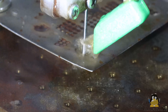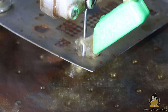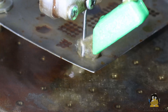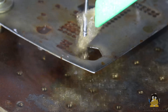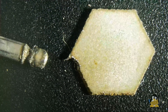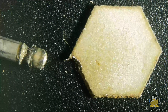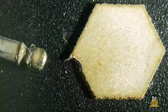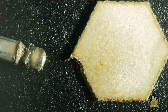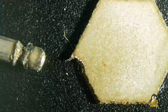In addition to drilling holes, the tungsten electrode can be used to cut parts from the steel sheet. This process also has potential for improvement. A look through the microscope shows that the tip of the electrode was almost cut off — it was supposed to be lowered continuously during cutting, but this was not done due to a software error. Despite this mishap, the edges of the 10mm diameter hexagon turned out sufficiently well.